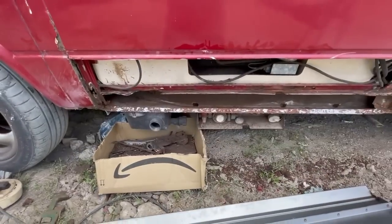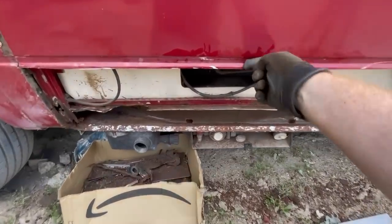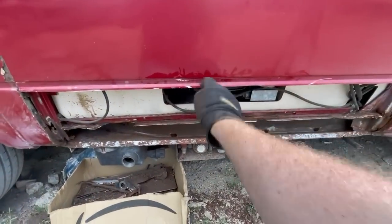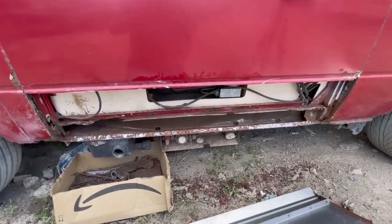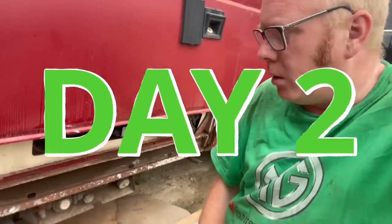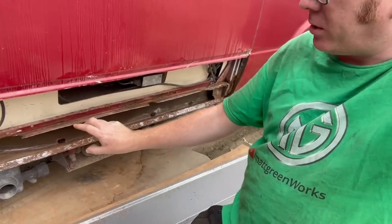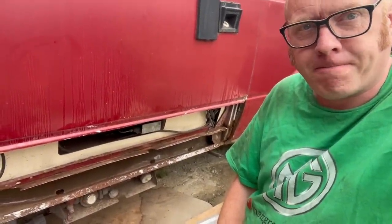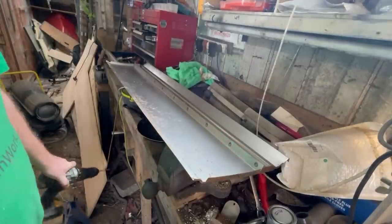There's not many spot welds - we could drill those out, repair the bottom rail, bend this slightly, MIG weld back through, then bend the panel back again. If we overlapped it on the top that'd be the trouble - we'd have to overlap on the top not the underside. I need to have a think about that and work out where the best place is to cut it. It's quite nice to try and leave as many bent edges as possible because it keeps the warpage down. So yeah, that's day one done. Day two - we're going to hoover this out with the Henry. I've decided to split this panel into two, build the bottom section, and we're going to prepare this section. It's now 10 o'clock and it's started to rain, so we'll come inside and try to drill these out.